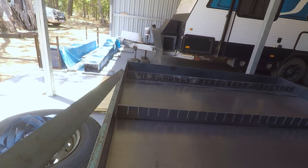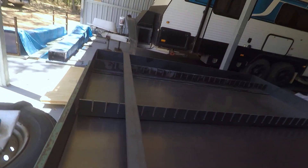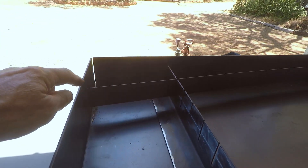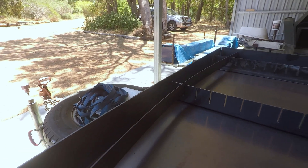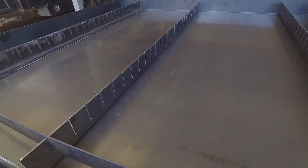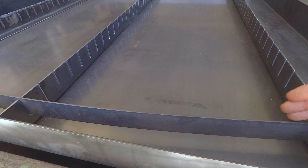Here's one I prepared earlier. These slats are 50 by 3 flat bar and they'll go on their edge. As I demonstrate, it fits in through there and comes around — so the slat in place is actually curved. It's sitting too low as I said, but they need to come up. The idea being that they're curved so when your torch is running up and down doing a cross cut, it's not running parallel across here all the time — it'll actually miss the slat.